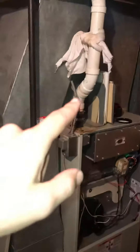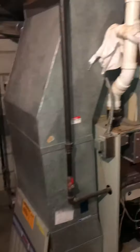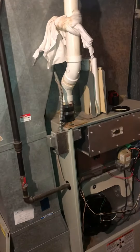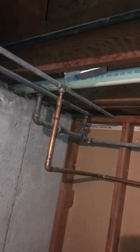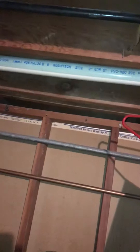This is the existing exhaust. They put a rag on it and it just needs to be redone — we need to make it look a lot nicer. We're going to need to change out this entire exhaust run. You can see it dips down right here, so that's going to need to be completely redone, going straight out from here. You may be able to salvage some of it, but I don't like the decline going outside. The runs are just done wrong, so make sure it looks good and is up to code.